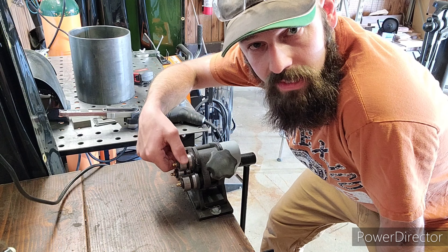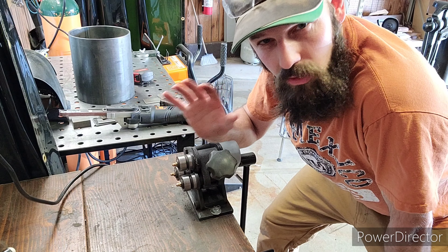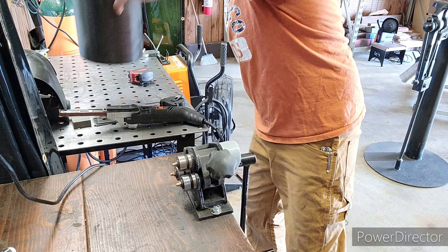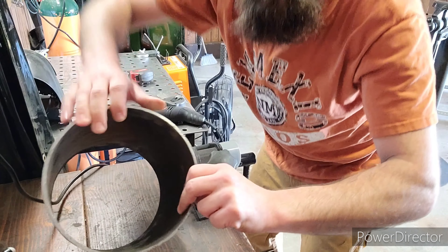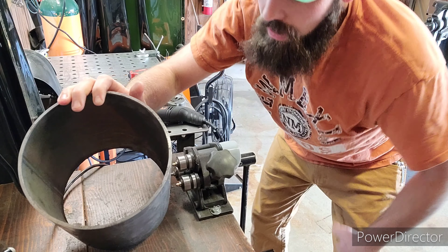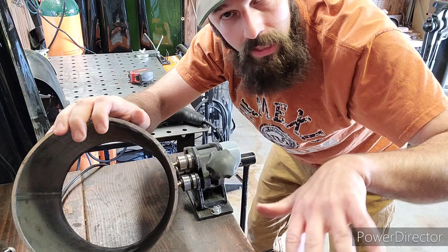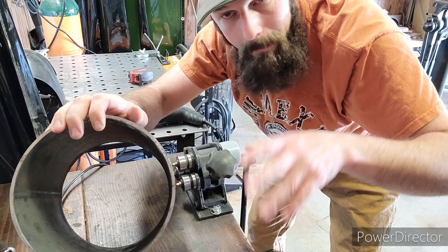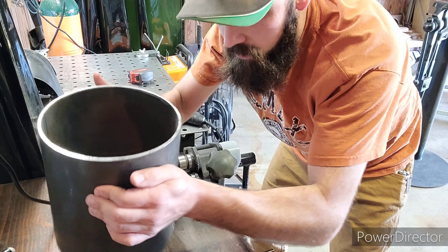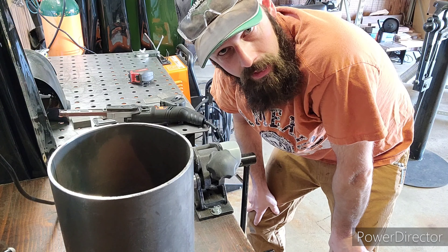We're back. We've got these knurls knocked down pretty far - I left just a little bit on so we'd get just a little bit of grip. The plan here is I'm making an alternative swage block. I'm thinking about getting into hand forging some skillets to go with my stoves, and I'm going to use this like a swage where I put a piece of steel on here, strike it down, and make that cup or bowl for my pots and pans. Since I'm going to be striking this with mild steel, I need to reinforce it - I'm going to put a steel ring and weld it up around the top to help keep it from flaring out.